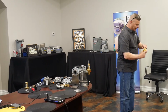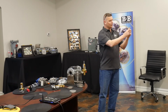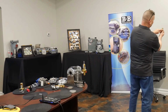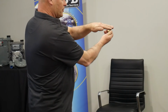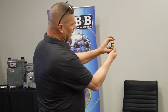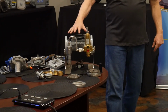Notice then, if you look deeper in here, how the outlet is down, the hole for the outlet is down in that pocket. And what's happening there is, because this cartridge is up in that recess and it has holes on those levels separated by these O-rings to keep the levels separate. What I'm basically seeing here is these are the holes that are normally where the gas is flowing straight through, inlet pressure 200 loading on top of the valve, comes straight through those holes, and it's sealed by those O-rings. But when this comes off of its seat, which we're going to open up in a second, it lets gas up through these higher holes, it dumps out the outlet. It dumps out this right here to the other side, creating a differential pressure.